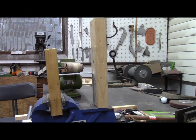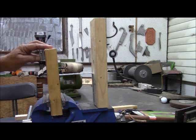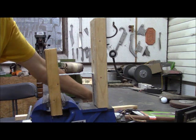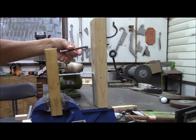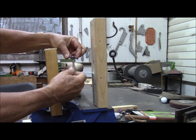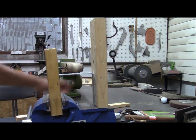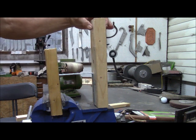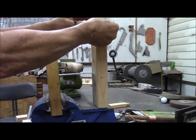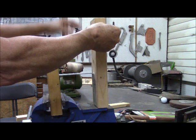This is a mock-up of the system I am going to be using. These are scrap pieces — a 2x4 left over from previous projects. They have already been used in one or two other constructions. I have this bracket, and a suitable size bolt that will go through the holes already pre-drilled in the stock, and even a wing nut that will fit it. We put a little block of wood here, screw these together, drill our hole, run the bolt through the support, have it support the gun itself, and then we are able to move it up and down as we need to.